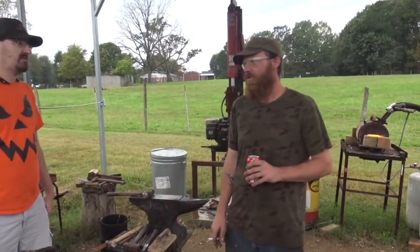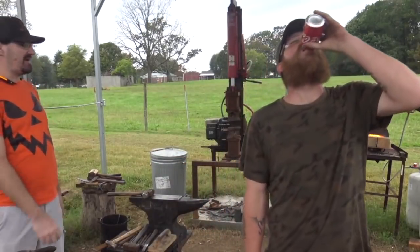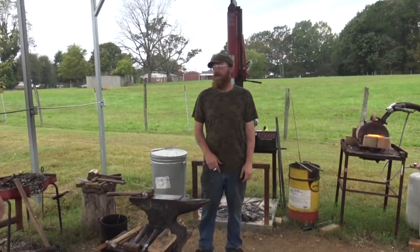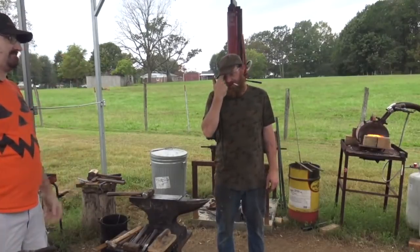It's a mower blade. I don't know if you use too much spring steel in a mower blade. They probably use more of a carbon steel. I oil quenched it, it skated a file, and I wailed on it with a hammer and it just wouldn't snap. I don't know. It's tough. Whatever it is, it's tough. Did it bend? No, but I only had a piece about that long, so I didn't really. Gotcha.